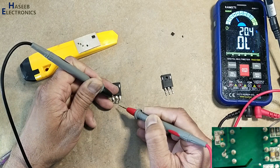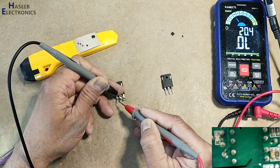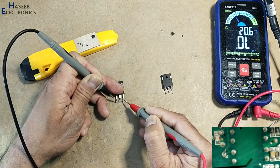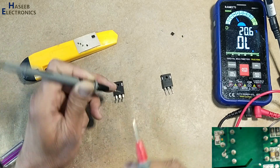Testing the new MOSFET: one diode, open circuit. Touch to gate — MOSFET on. Now discharge MOSFET. Diode test — this MOSFET is good. Now we will install it in the circuit.